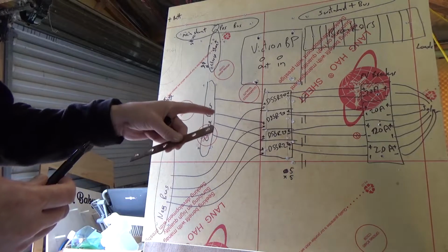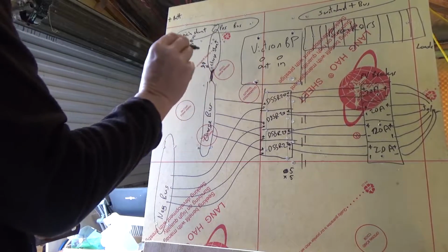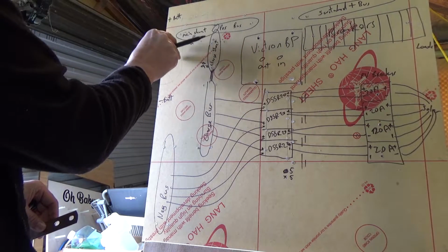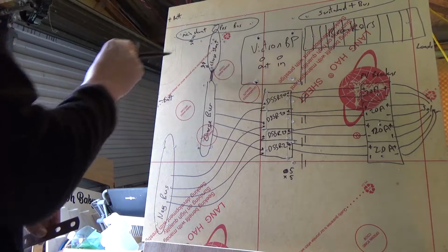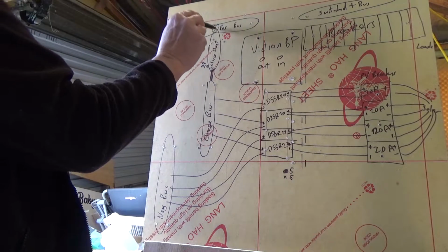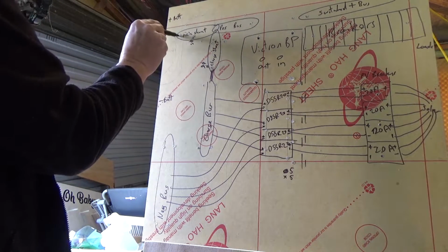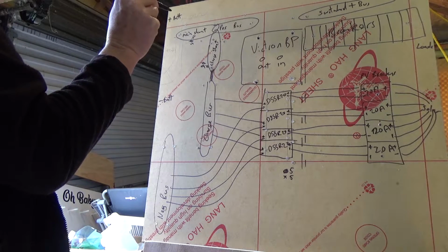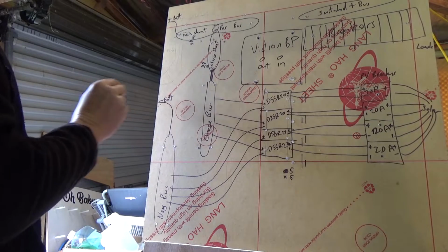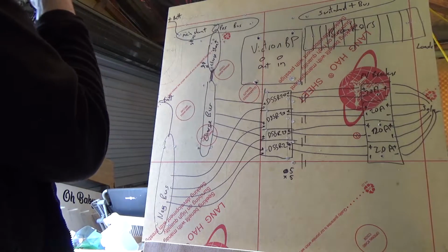I now will have the ability to put positive into the positive bus bar and negative into the negative bus bar, which is of course connected to my charge shunt. Now that's the shunt that's specifically measuring the charge coming into the battery, and it doesn't see any load whatsoever, and it looks a lot like that. Now that is connected to the positive bus, so this is the load bus really, and that in turn is connected to the main shunt, very similar to my charge shunt, which goes to the positive battery. And the negative bus goes straight to the negative battery. In fact, it doesn't go direct to the battery, it's going to my catastrophe fuse.